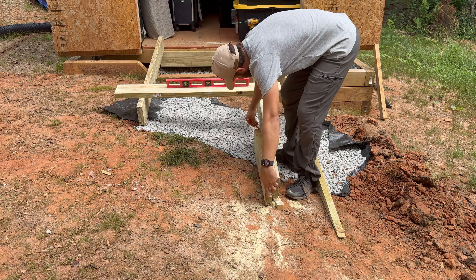On the short joist end, I measure six inches from the end and place a 2x6 across all of them to square up all the joists one at a time. Now that the ramp is squared, you just take one 2x6 at a time and install them going upwards.